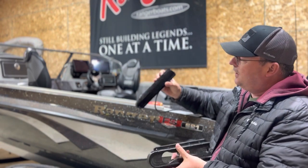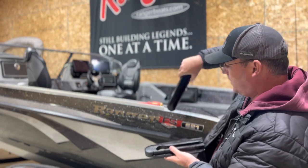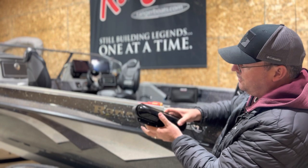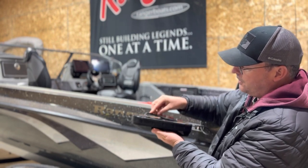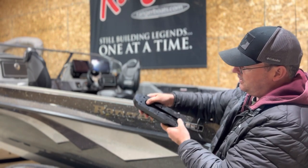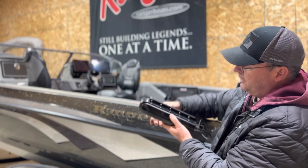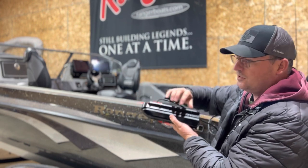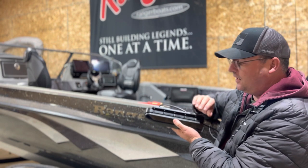Here is the active imaging 3-in-1 HD transducer that I received, and it's going to go inside of this mount. One of the things that you'll notice is that because the wire comes out on the top, it's designed to fold that wire inside that bracket without bending the wire. And because Ryan likes to build everything a little bit extra heavy duty, as you can see here, this is a little bit thicker than the original flush mount kit that we used on the original side scan AI2s.